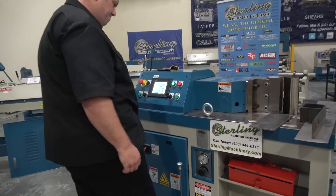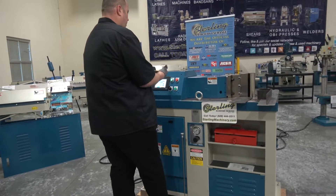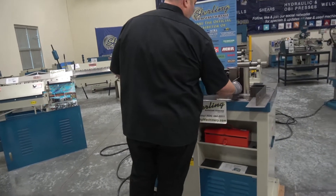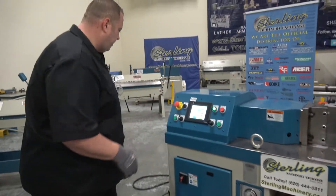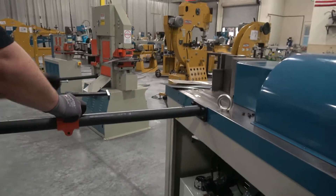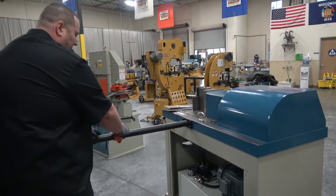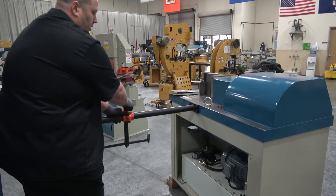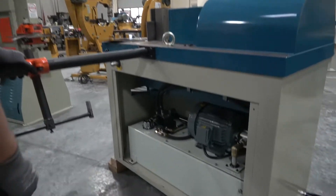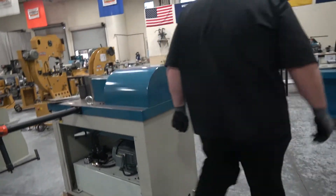Set it on foot and you have the same operation. We'll go ahead and put our piece in. One other thing I'd like to point out is the back gauge — depending where you want to put it, you lock it in and set your piece so you can hit the same position every single time. You'll be able to do all your different jobs and know exactly where you're at; there's a nice little meter right here that shows you. We have the back taken off just so you can see the hydraulic tank — we just put hydraulic fluid in this guy. Everything's running really nice, super clean inside. Nice machine.